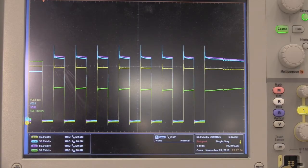Shown here is the voltage sharing between four series connected silicon carbide MOSFETs without any control under an 800 volt DC bus at 20 kHz switching frequency. Devices 1, 2, 3, and 4 are connected in series, where device 1 in green is the bottom of the bus, 2 is in purple, 3 is in blue, and 4 at the midpoint of the bus is in yellow. This result exemplifies how the mismatch in voltage between devices is difficult to predict due to differences in device parameter tolerances and layout parasitics.